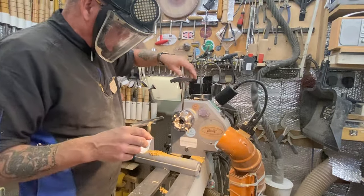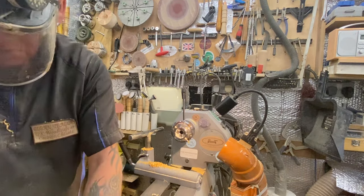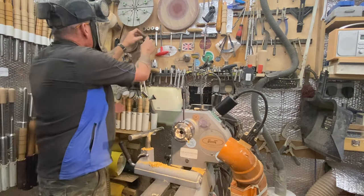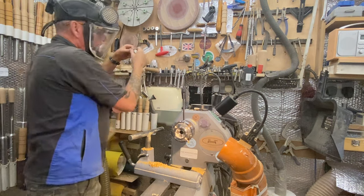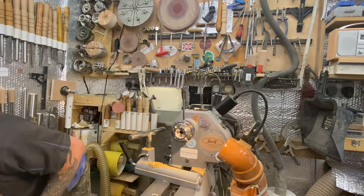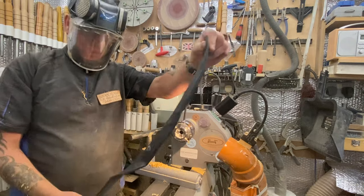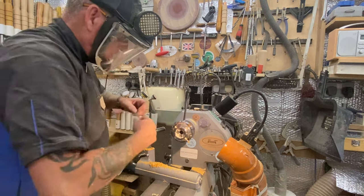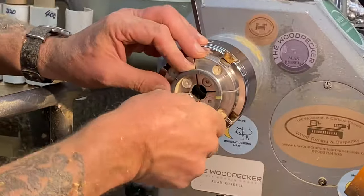So, a little tip for you guys. Because it's not going to be a perfect circle, see? Now, I could maybe... No, I can't, see? My next size jaws is that, and that's too big. So I can't get it on a set. So, a little tip for you. You get yourself a cycle inner tube, okay, that's what that is, bike inner tube. I've got one here, look. You can get all different sizes, you can get bigger ones if you want bigger ones. That's all it is. Just cut yourself a piece off and pop it over your jaws, like so, okay.